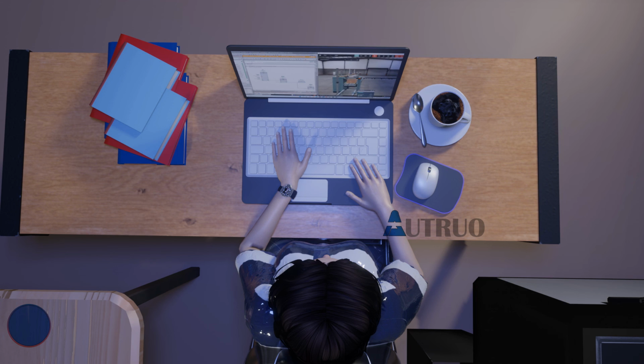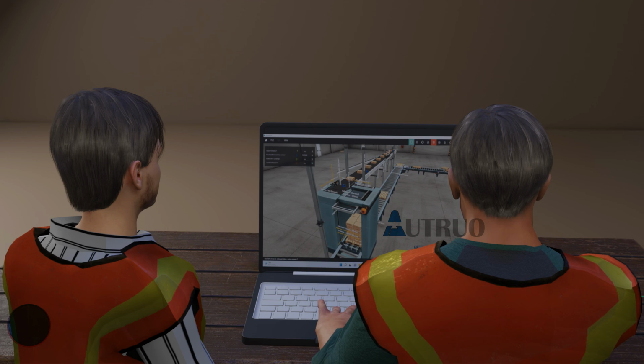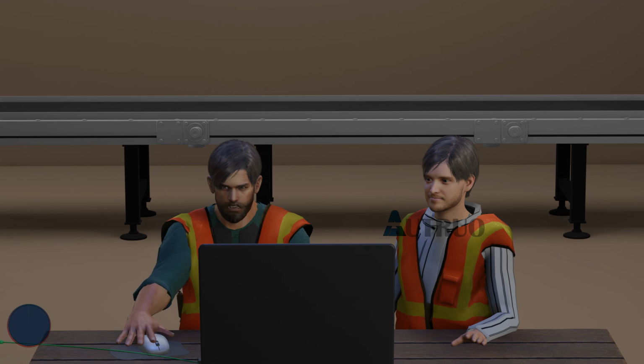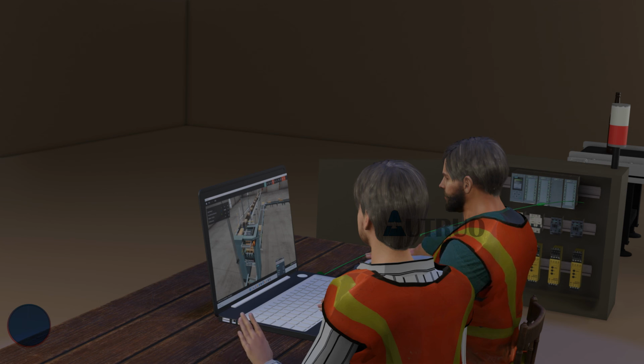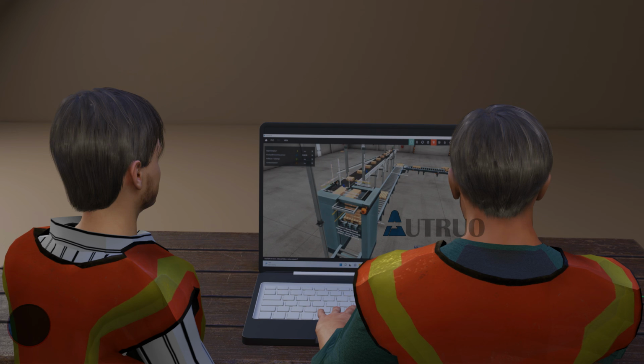Perfect, Andrea. This stopped the pallet conveyor. And it also stopped the box conveyor when the stack count is reached. What I described is already taking shape. Perfect. In the coming series, I will be writing the last set of instructions which will be used to synchronize the downstream conveyor with the palletizer.